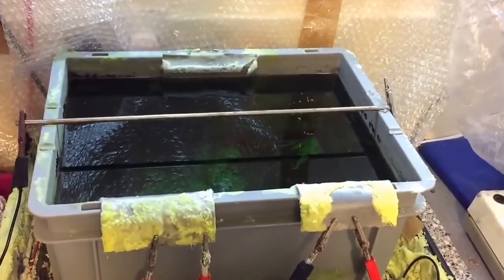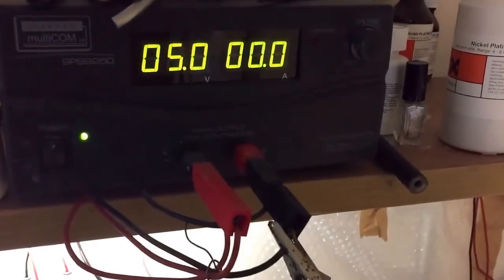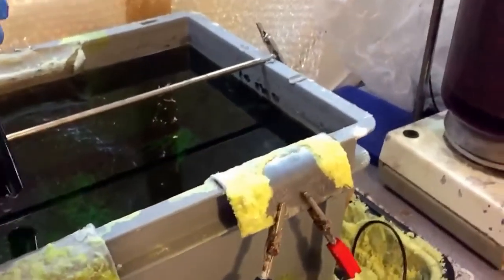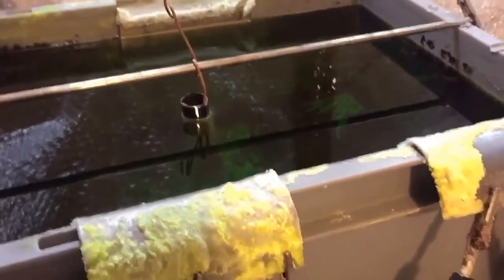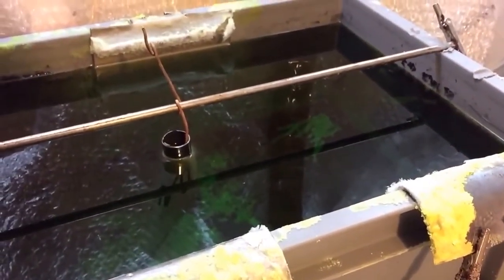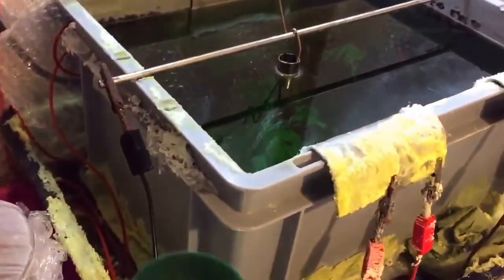You can see three stainless steel electrodes in the tank, just normal stainless steel bent over — simple, easiest chrome stripping, no fuss. Switch the rectifier on. Put it on 5 volts. Then put the item in — I'll only submerge part of it, leaving a little bit out on top so you can see the color difference. It strips very very quickly, basically within seconds, but I'll leave it in about 30 seconds to a minute, depending on the item and the thickness of the chrome plating.